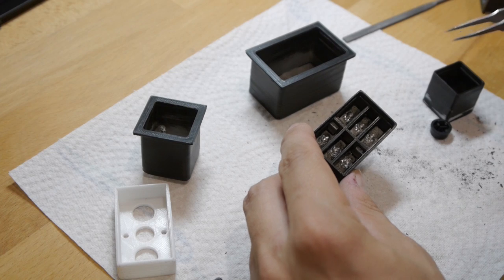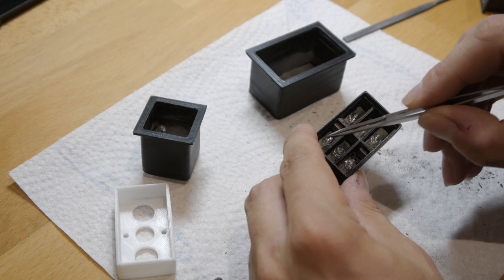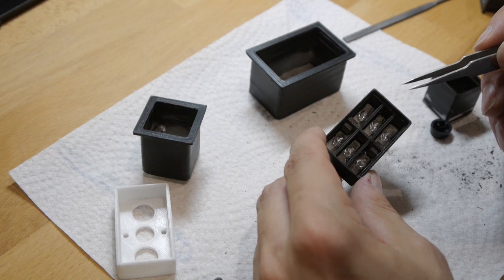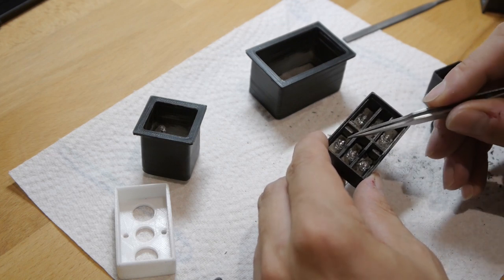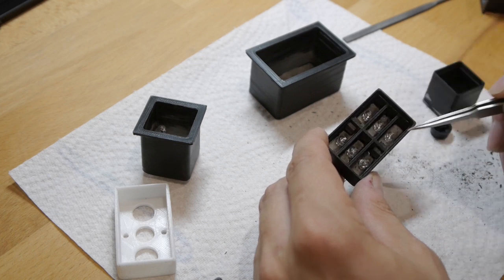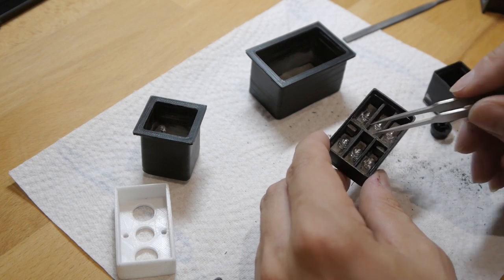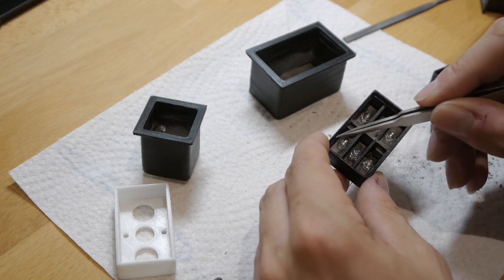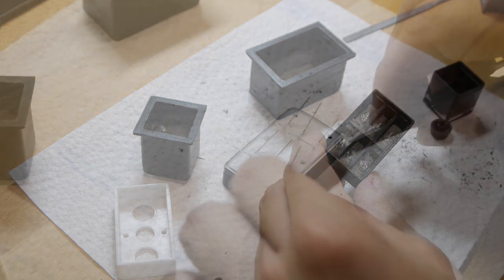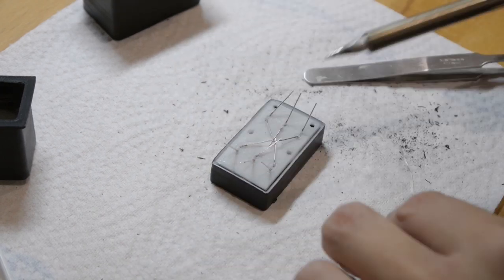For many annunciators I have seen, people are using two LEDs on the left and right in those small cabins here. And this is because the LEDs are emitting the light in a very small angle to the top. But these LEDs I will use here emit the light with a 120 degree angle, and so I hope I will cover all this place here with only one LED in the middle. I bent all the cathodes together to construct a shared ground connection.